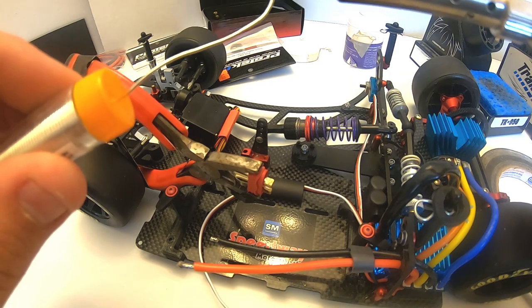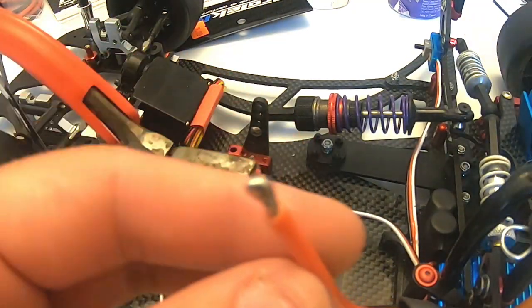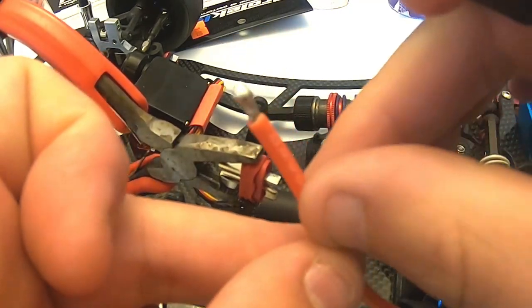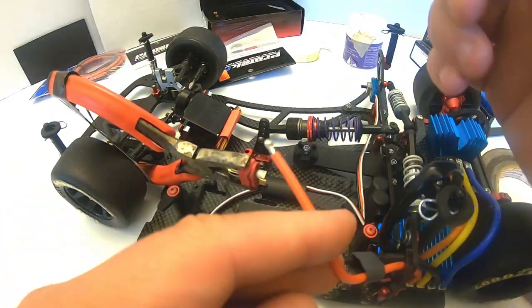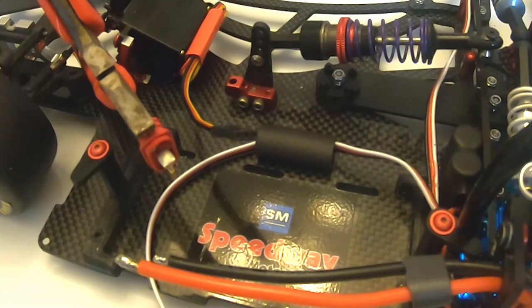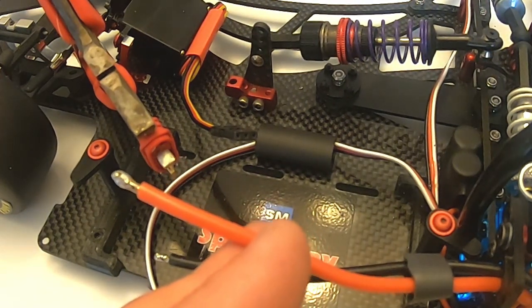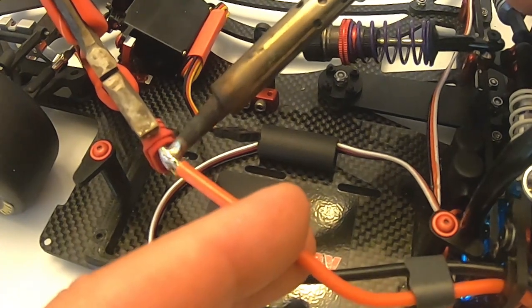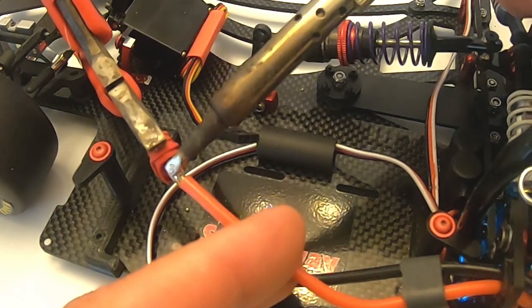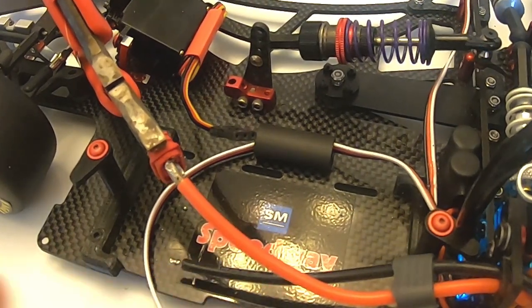Now what I'm doing is putting some flux on that wire, just a little bit. Then I put flux on the bit as well, and I'm putting just a little dot of solder on there, then adding a little bit around that wire. That's going to put two fresh contact points of solder and make a great solder joint between the plug and the wire. Sometimes I hold the soldering iron in between the wire and the surface I'm soldering it to, to get them both almost to a melting point, then I press down. I hit both sides, hold it down, hit both sides again, hold it down on top for a moment — you'll see that solder move — then I take the iron off, hold it just for a moment, and boom, it's done.